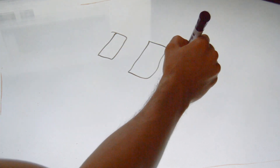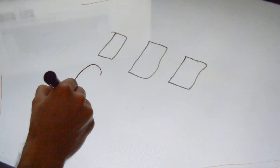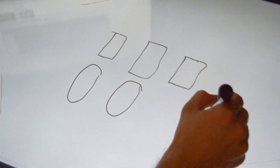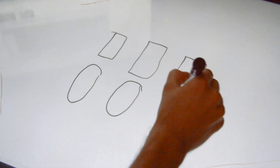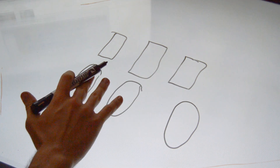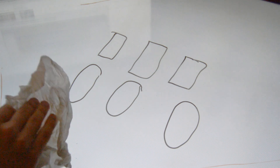The same applies if you're trying to plate ribs — looking at the top view, it's best if you can round the edges and maximize the distance between them. Spacing them further apart allows the deposition to even out within those ribs.